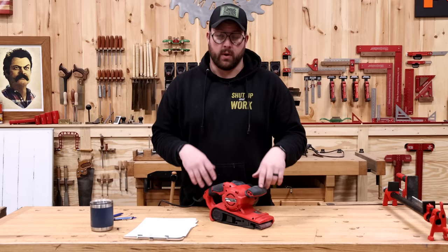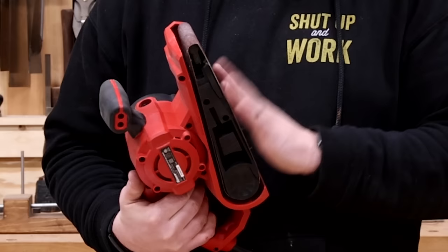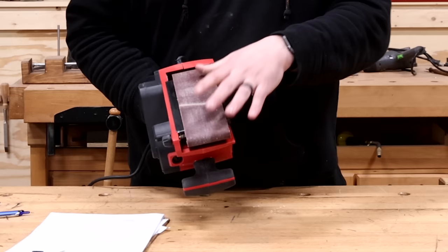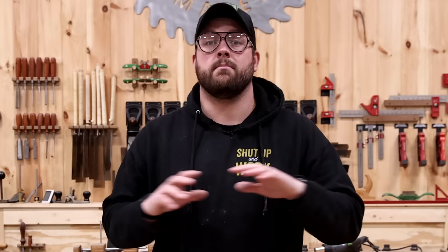When it comes to using the tool, I've run into gouging material a ton with a belt sander. I've also had problems with the band tension — once it heats up it expands and falls off, always having issues with that. Dust collection actually sucks because there's no way for dust to be collected inside the belt itself. I just really realized that the tool is not what I needed it to be, and for the price you have much better options.